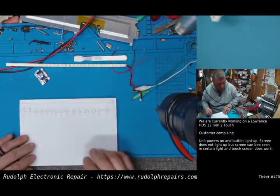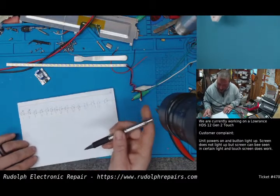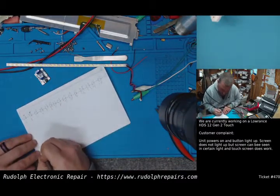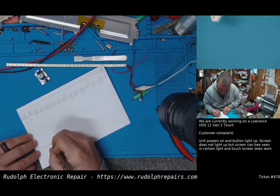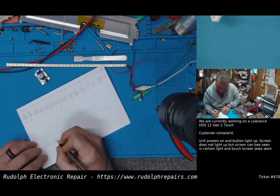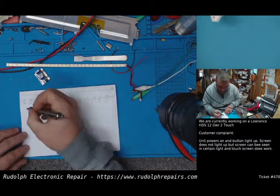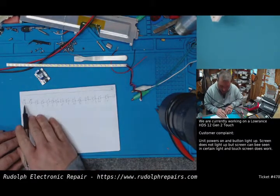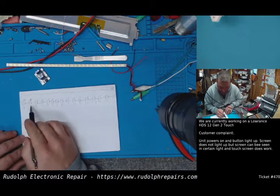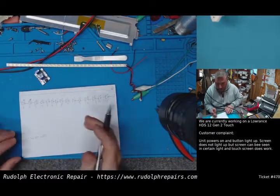Okay. So we know 3 is our max voltage. So let's write this down. 3 volts max per LED, just so we know. Okay. So if 3 volts is our max per LED, it would make sense that if we came here and here, tried to power 2 LEDs, 6 volts would be our max.